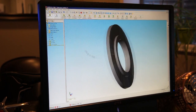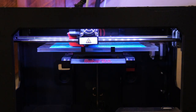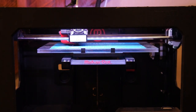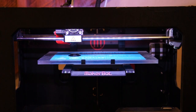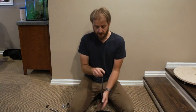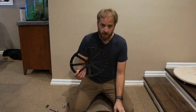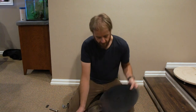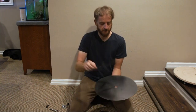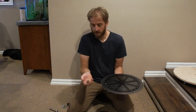So when I put the bearing together, I'm going to need some spacers to help keep everything concentric. I've drawn some up in SOLIDWORKS and we're going to 3D print those. I'm using what is effectively a large thrust bearing — a low-profile Lazy Susan bearing chosen because it's used by a lot of telescope manufacturers in OEM bases. I bought a set of 15-inch diameter round plates on eBay, cut a 1-inch hole in the center, and the bearing sits on these plates, which act as the bearing race. To keep everything concentric, I 3D printed a pair of bushings.